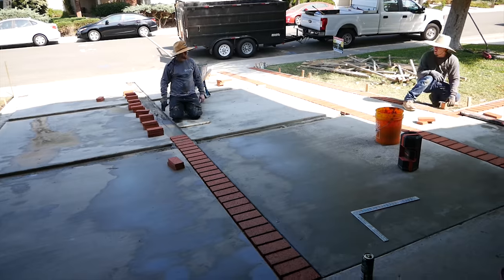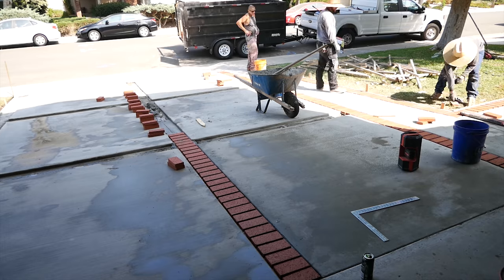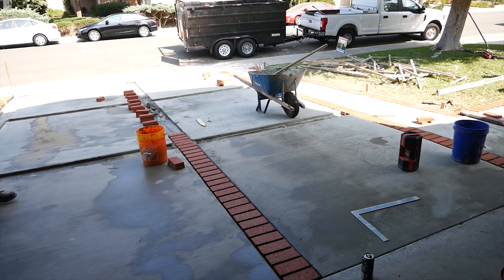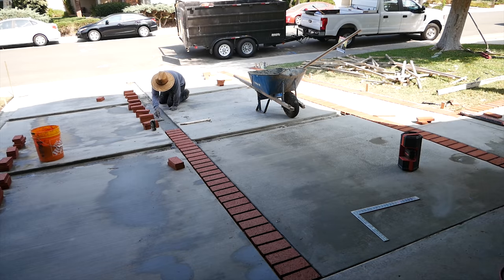When you're running down your brick ribbons and you have two adjoining concrete slabs, matching elevation is really easy to do. Any straight edge — like I was saying before — you just match both sides, top of brick, and you're on the money.